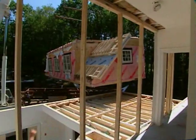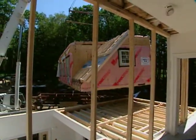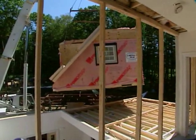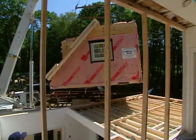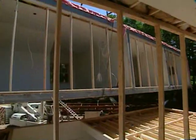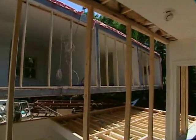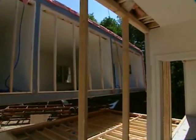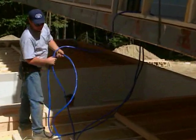And when you have the kids upstairs running around or there's people upstairs, you're not going to hear that noise because of the framing member being a different member than the ceiling member below. That's a beautiful thing in the modular technology. And you can use the modular technology, for example, for a 2-family house so that you would also have noise abatement between one unit and the unit down below. That's a great example of where our technology really does exceed stick-built.